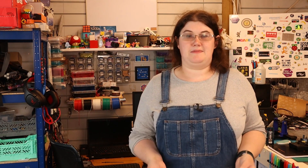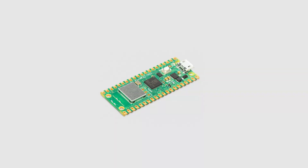I started thinking about what I was going to use for this project. The first thing was a microcontroller. I wanted a USB keyboard that I could type onto, so I needed a microcontroller that could take that USB keyboard input and read what I'm typing, so I can make my dots and dashes based on the typing. I've picked the Raspberry Pi Pico W. This can take my keyboard input and output it as audible dots and dashes. And because it has the W feature, I can connect it to the internet and send my Morse code anywhere in the world. Let me know if you'd like me to send you a message for you to try reading.